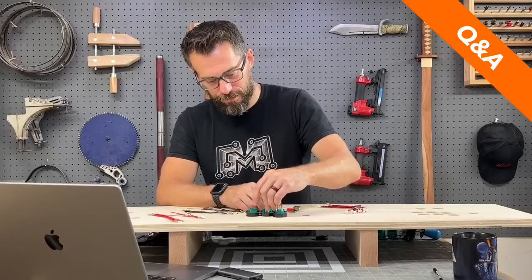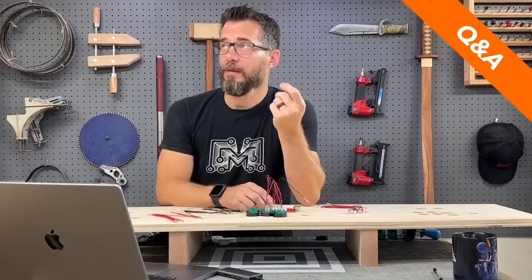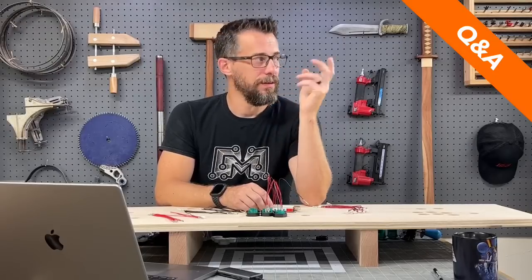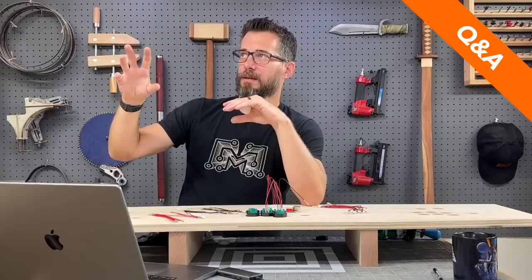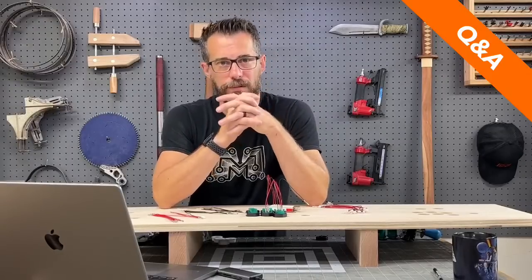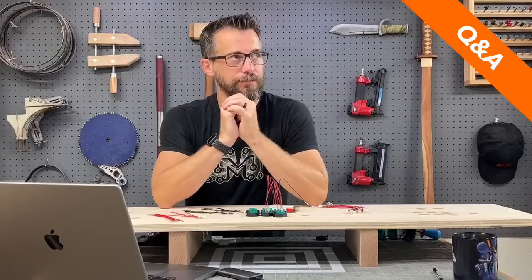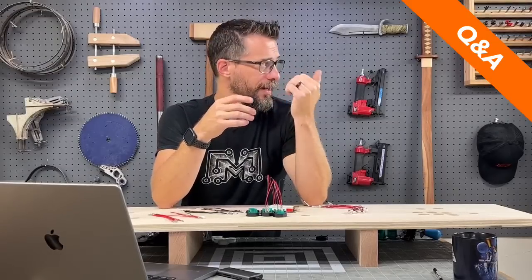Sure. All right, how is your dust vacuum system holding up? It's still holding up. We ended up taking out the automatic section of it. One of the relays burnt out, and about that time we got the new CNC, so we didn't replace the relay, and we separated out how it was working. So the automation is not there anymore, but we didn't really need it. Now the tools have moved around a little bit to where they're clumped and very easy to manually manage. Also, I think since we did that video initially, I got a much bigger dust collector.